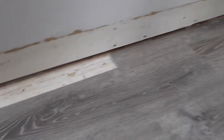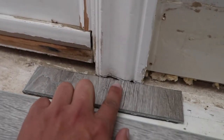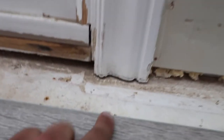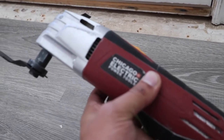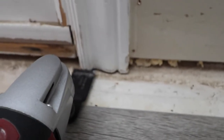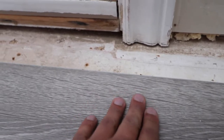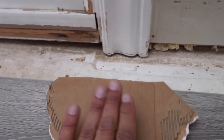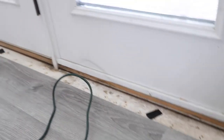The floor is pretty much all down and we're working on our very last edge. You might run into door trims like this one going to our outside patio. We took a little piece, found the threshold tolerance, and marked it with a pencil. They make special door jamb cutters for this, or you can use an oscillating tool — we picked this one up at Harbor Freight, Chicago Electric. Get in on that line and start cutting. Make sure to put some cardboard down so the oscillating tool doesn't nick your new floor. We'll do that for the door jamb in the center and at the far end, then slide and tap the planks in.